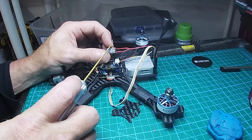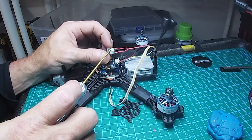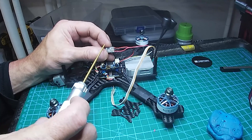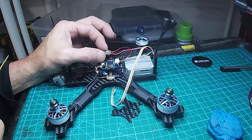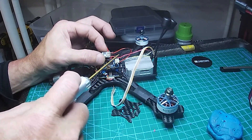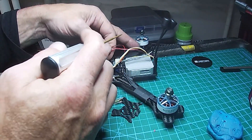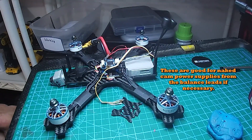This is the way you really want to do it on an analog VTX if you can shield it. This is also the way you want to handle a GPS module if you have the time and parts. The best way to get the least amount of noise is to try to put the power supply away from all the noisy stuff like the motors and ESCs, and try to shield the wires as much as possible. Some people even put a capacitor across the leads and use a shielded cable.